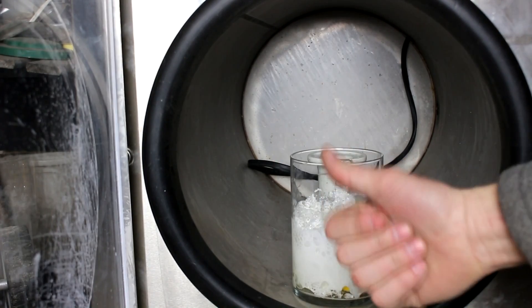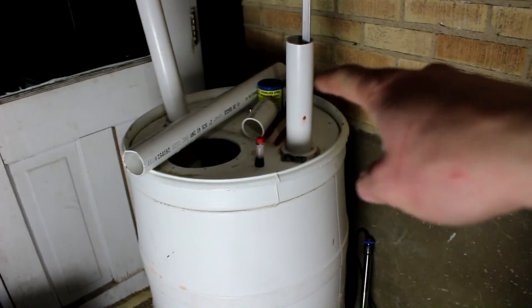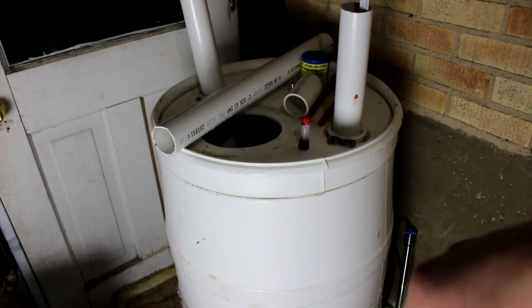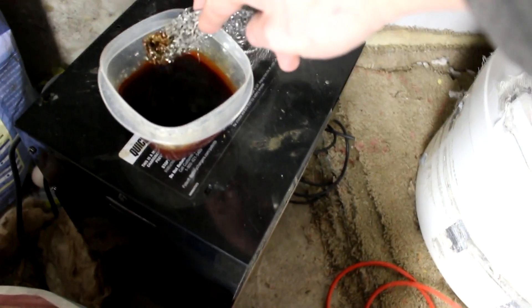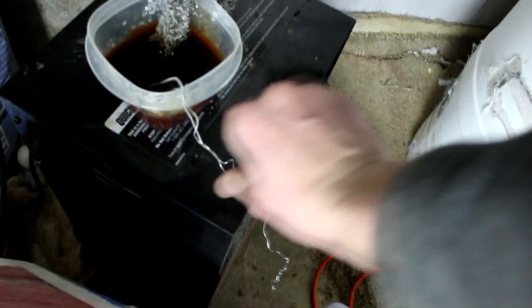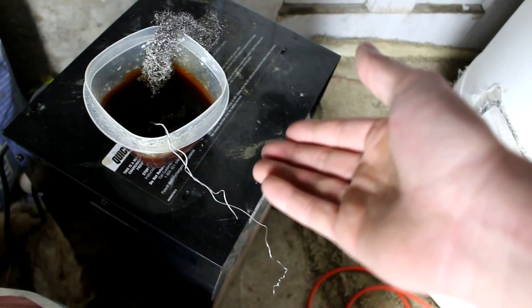So it seems the shell of the egg and even the membrane with a little bit of stretching can support the internal pressure from the vapor pressure of water — only about 5 millimeters of mercury, so not a lot of pressure, but enough to puff up the egg whites into this fluffy material. Well, that was cool. Hope you all enjoyed — I'll see you next time. Quick update on other projects: my methane generator is coming together well, almost done; I just have to finish the heater and start it composting, which could take months. I've also been testing different types of stainless steel — the stainless steel wool doesn't handle electrolysis well, but the wire, with a little discoloration, is able to handle it. I'll be sticking to the wire.